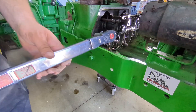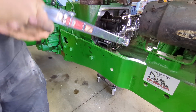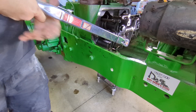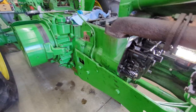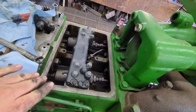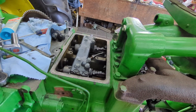I'm going to torque my hold-down nut on my side — 50 foot-pounds, no more no less. That's all it takes. Those are back in, got the returns back in. The only thing left to do is put the cover back on. We have the new cork gasket for it — we just need to glue it to the cover, because that makes it easier, then set it back down and put the bolts in.